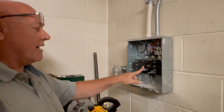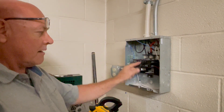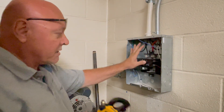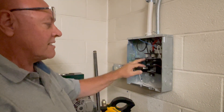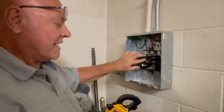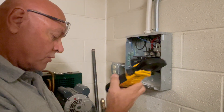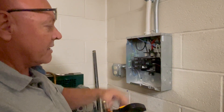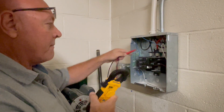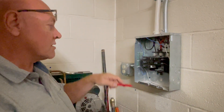This one right here, you can see that it's two circuit breakers together — they're connected together, so if I flip it, both of them go at the same time. This is single-phase because I don't have three of them; there's two of them. It's single-phase, but it will read 206 volts because I'm doubling up on it, taking it across my main two lines coming in, which we showed was 206 volts.